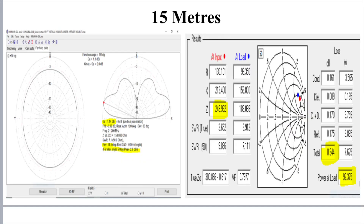Let's go on to 15 metres. On the left-hand diagram, the azimuth at five degrees off the horizon — omnidirectional of course — shows minus 2.8 dB, which is reasonable. Maximum gain is 1.1 dB at 14.5 degrees off the horizon — pretty decent for a vertical. On the right-hand side, we've got a decent impedance being presented to the tuner of about 250 ohms, and a similar loss to 17 metres of 0.3 dB. Pretty reasonable.